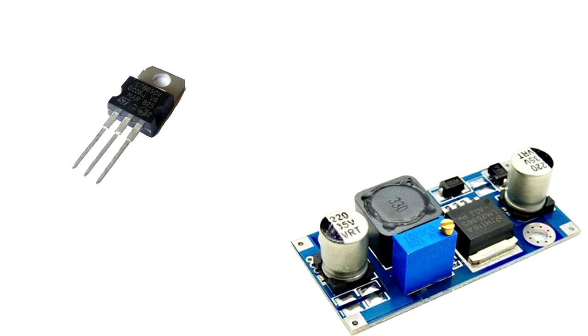That's a photo of one, but there are a number of them on Amazon and different sources. These are switching power supplies, and where the LM7805 or 7809 will run a little bit warm, that means they're wasting a little power. These newer switcher devices don't do that, so they would be a better option if you're trying to run off battery power.